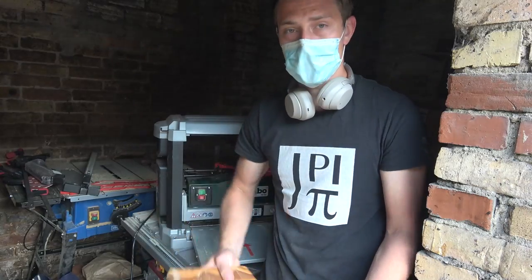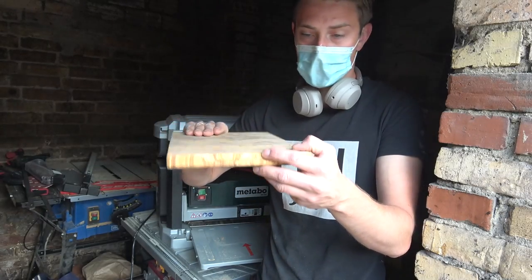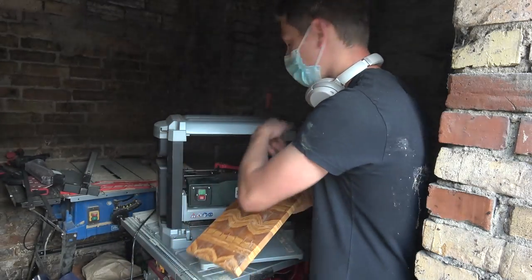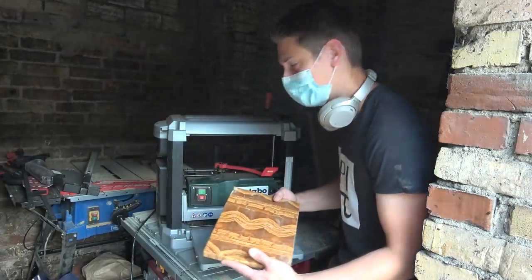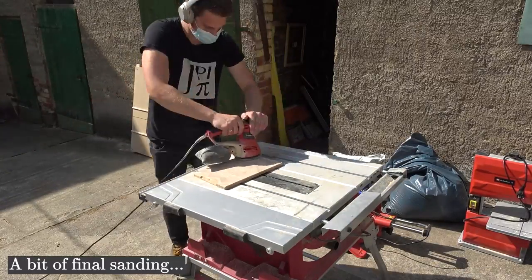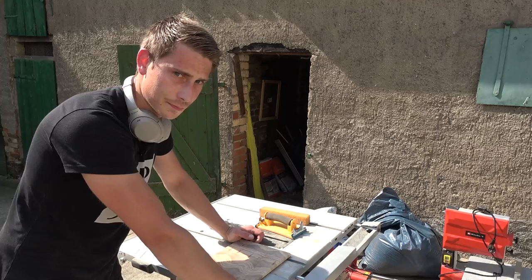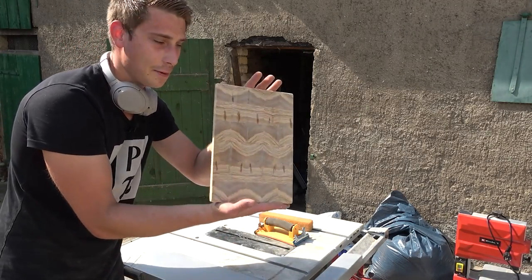First side done and I'm pretty satisfied with the result - just take a look at that, everything's perfectly flat. Apart from the one tearout on the side. Now I'm going to continue with the other side - I'll leave the mode as is, turn it down one quarter of a rotation, and get this side flat too. That's so amazing that it works out. And thus we are done - I'm going to officially call the myth that you can't put end grain boards into a thickness planer as busted. Now as a little bit of fan service for the YouTube algorithm, you can watch me oil this amazing piece of wood.